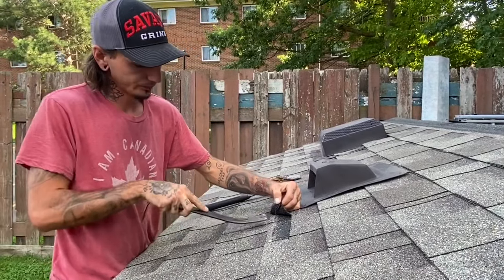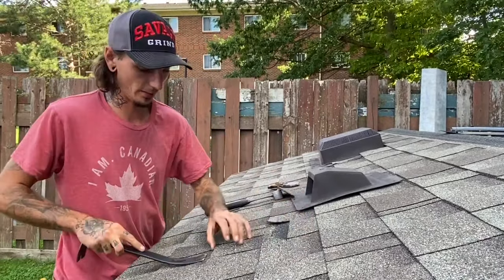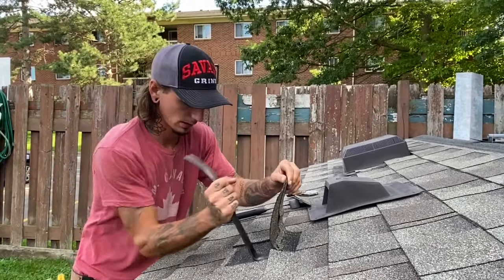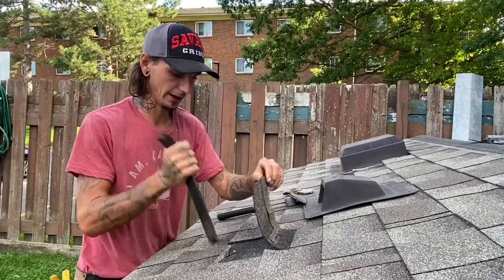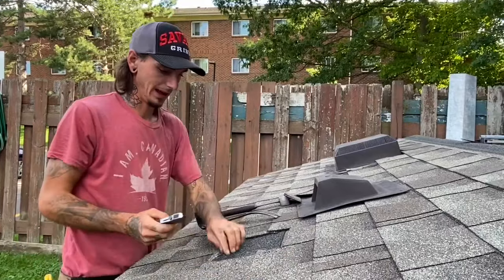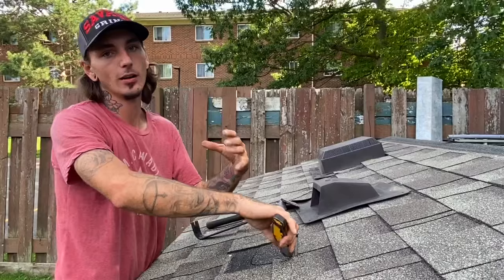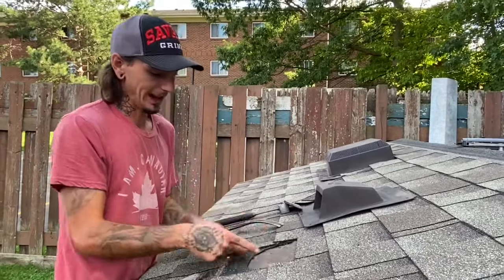So you can see I got two nails here, and there's a nail here but it will be back far enough out of my way. We're going to lift this one — make sure you get those nails completely out of your way. This is where that circle was, so you would have to cut out. Most people like to go around to where their actual penetration of the vent is coming out — usually this is like a bathroom vent kind of thing off your fan — so you'd cut out that circle. And that's where my vent's going to land.